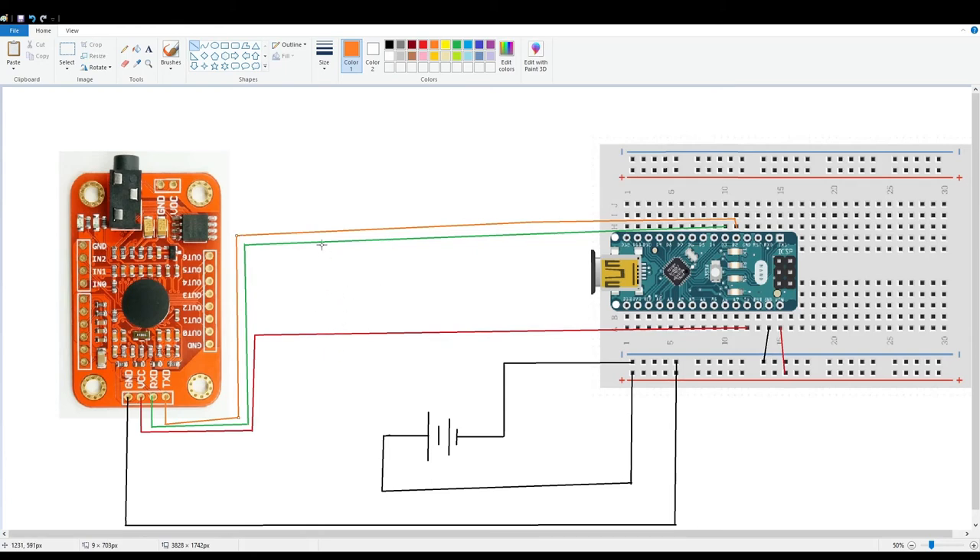Now we have everything hooked up to the Arduino and the speech recognizer with the battery. The layout I drew — Arduino on the right, speech recognizer on the left, battery at the back — mirrors how it will look inside the shoe, just like the CAD from the first video. Drawing the CAD first helped with visualization. Now I'm adding an LED: I thought about grabbing a photo like I did for the other components, but an LED is just a positive pin and negative pin, so I'm drawing the standard circuit symbol for it, same as I did for the battery.